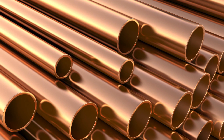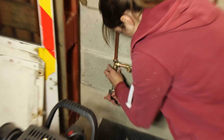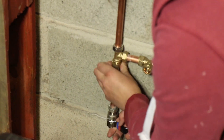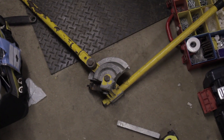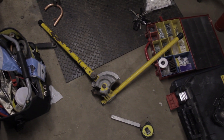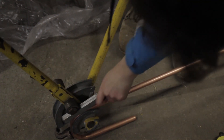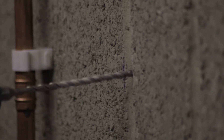You may need to seek out the services of a plumber to solder and form the pipes, or make use of compression fittings that are more DIY-friendly. Then begin forming the coils using a pipe bender — you can buy a professional pipe bender or a budget pipe bending spring from Rothenberger for less than £5. Then mark, drill and plug the holes for the pipe clips that hold the pipe securely to the wall.